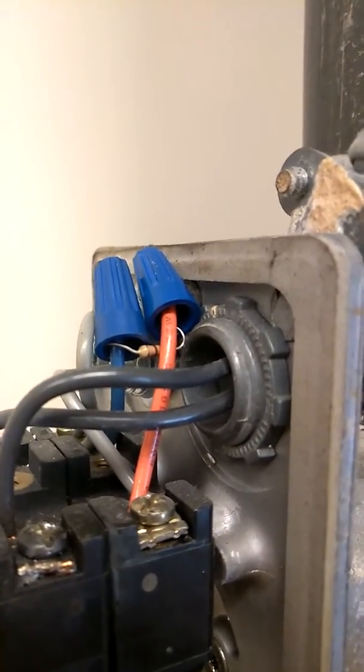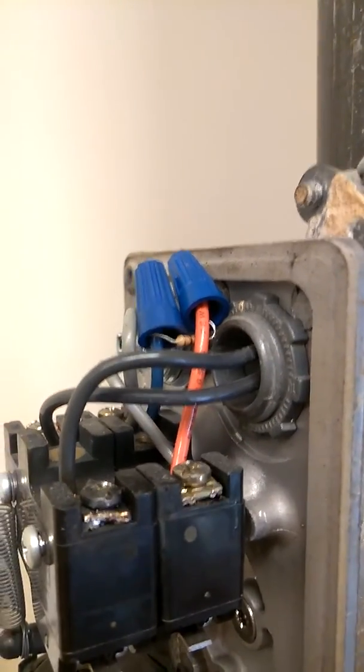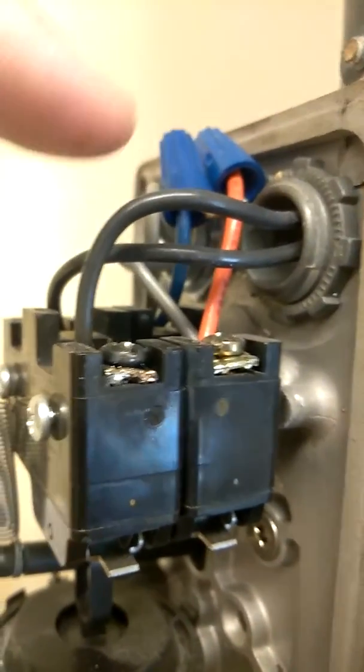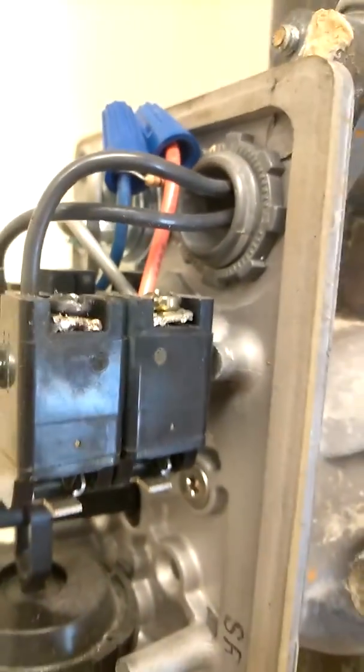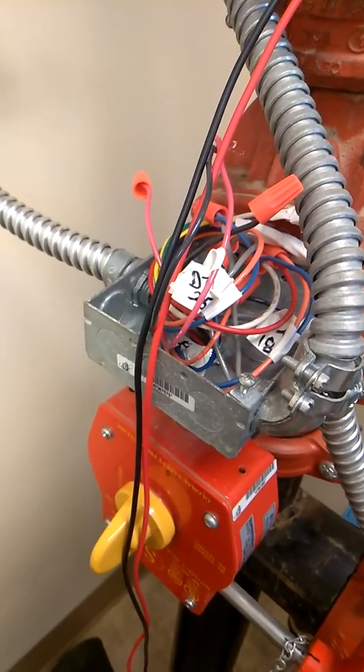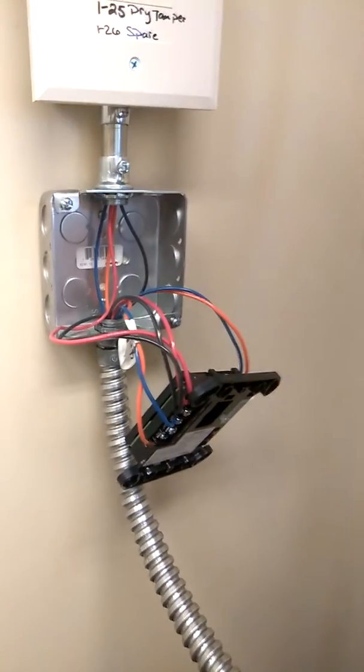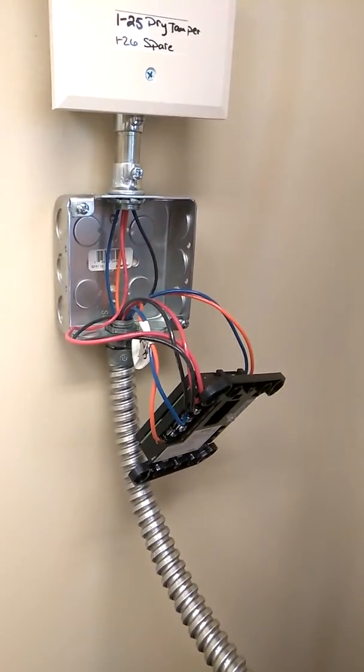Either that or use one that's got heat shrink around it. You can even make the ones with heat shrink yourself — solder on two legs, see how they wire another leg on there, solder on the leg and then put heat shrink over the entire resistor, then lay your legs down. That was a pretty easy find. Also use deeper boxes — it's a pretty shallow box to shove all that in there, and that would cause ground faults a lot of times because it would cut into the wire.